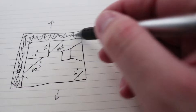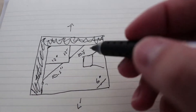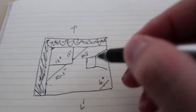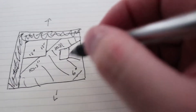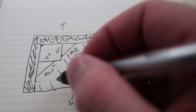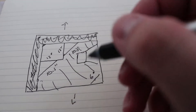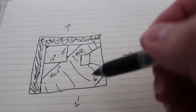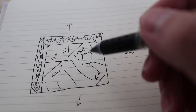You're just looking for this volume. Port volume gets subtracted because that's where the frequency resonates, and you don't actually want to add that into the volume of the box. This is your loading chamber — everything I'm cross-hatching right here. That's where stuff actually loads and then allows it to push the sound wave down and out. We'll see how this works with my box, with everything slanted down — it might play a little weird, but I think it'll sound pretty good.